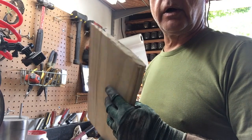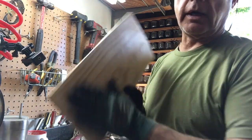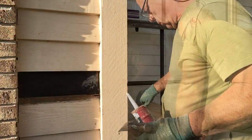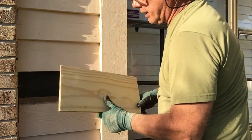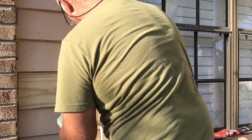This is what I wound up with — this is my piece of clapboard, lapboard, whatever you want to call it. This clapboard nails directly to the studs. There's no sheeting under it — when I say sheeting, I mean like plywood.